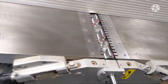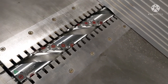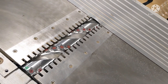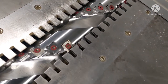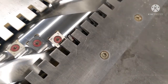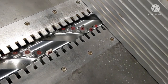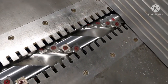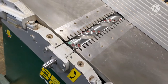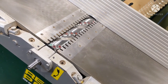One of the things that has changed in the last couple of weeks is a new block on the planer thicknesser — it's a spiral block and I'm really pleased with it. Massive improvement on the original straight knife block which had loads of tear out. It's not a proper helical, just a spiral. The blades have a 95mm radius, so they've got a slight curve to them, giving a very slight shear cut, but they are parallel to the cutter shaft, so they're not a true shear cut. Even still, massive improvement — really happy with it.